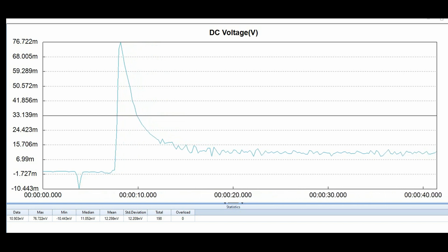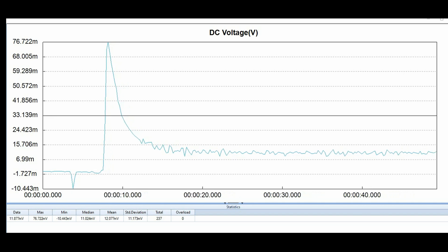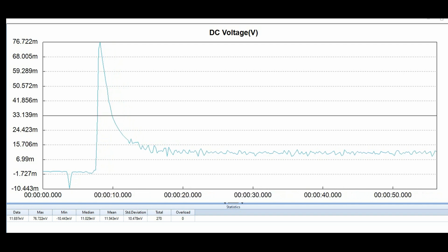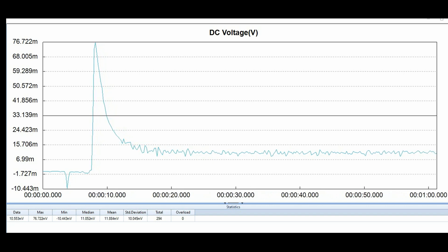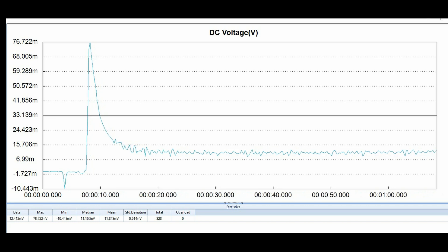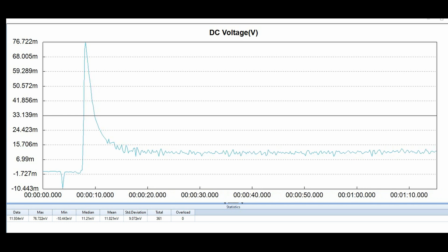What you just saw was another normal power-up — it spiked up to about 80 millivolts and then fell back down to 10 to 15 millivolts, just going along perfectly. I'm going to go ahead a little bit in this one. The last run had everything happening early, but this one, as you can see, looks fine — it looks perfect. We haven't gotten any extra spikes. If you've got an amplifier doing what this one's doing right now, you'd say it's working great — because it is, if it would just sit there at that 10-millivolt level.